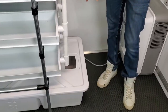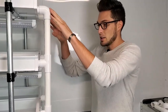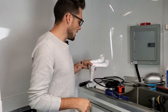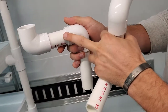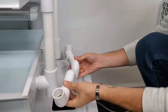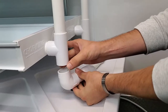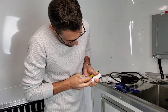We had to wait a few days for the reservoir to arrive. Now we can finish the plumbing. I've created connections that go at the bottom — it's a 90-degree elbow into about a four-inch piece, into another 90-degree down into another four-inch piece. This plugs into the bottom of the PVC and acts as the drain going straight into the reservoir. We need a two-inch piece of PVC to connect the two parts.